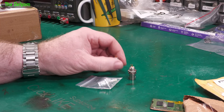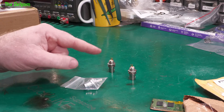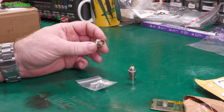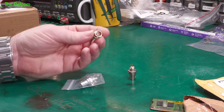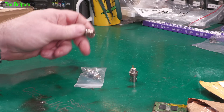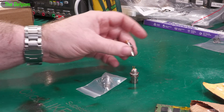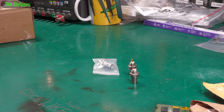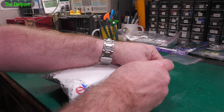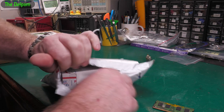I was trying to find some adapters because I know you can get them, but I could only find ones that went from two lug to three lug. I couldn't find ones that went from three lug to two lug. If I could get a three-lug triax to two-lug triax adapter - like a female to male adapter - then I could put that modern connector in and still use the two-lug cables. Can you guess where this one came from? Guess is down below in the comments. I'll give you links to things in the description as always.